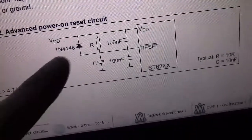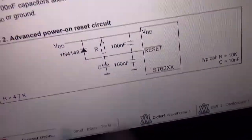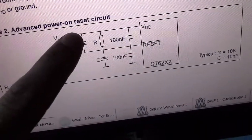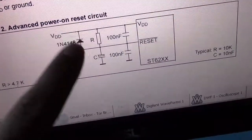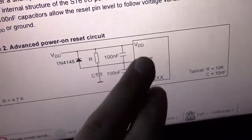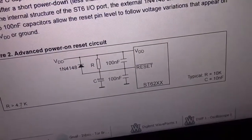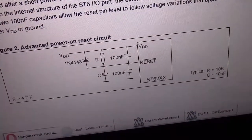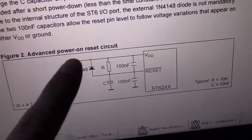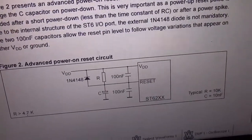Well, actually it will, because this diode, like all diodes, has reverse leakage current, especially if it's a Schottky. And so it will let a little bit of current go to the reset. And while that will be delayed, because this reset uses such a little amount of power, you know, in the nanoamps, it will activate the circuit. So that is another option in some cases, and especially in my case, I could actually just use a single diode to also help that curve improve.